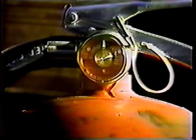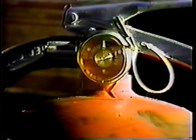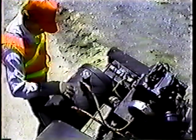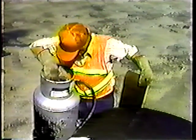Once the tank is full, continue with your daily checks. Make sure you have a charged fire extinguisher on hand and that it's accessible — don't put it on the tar pot, you have to be able to get to it if there's a fire. Check the gasoline and diesel fuel tanks; make sure you have enough fuel for the engine and enough diesel for clean out. Also make sure you have enough propane — if not, refill the tanks or exchange them for full ones.